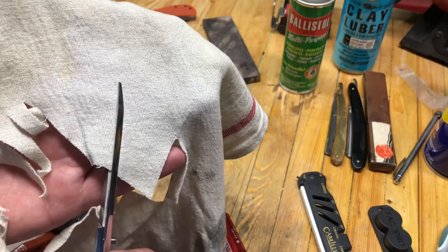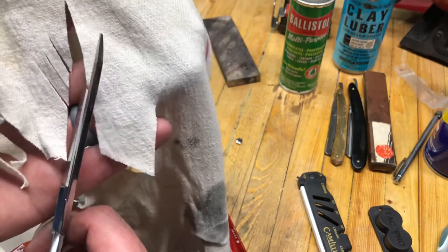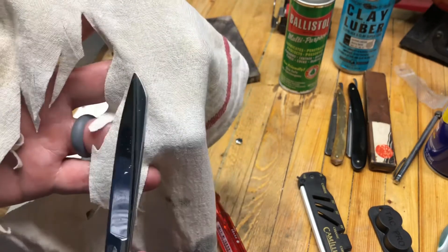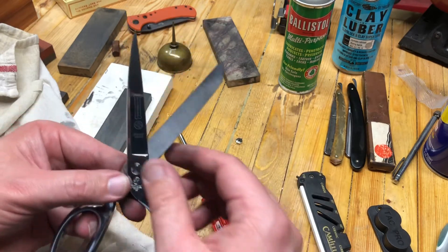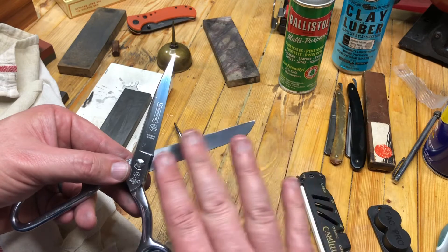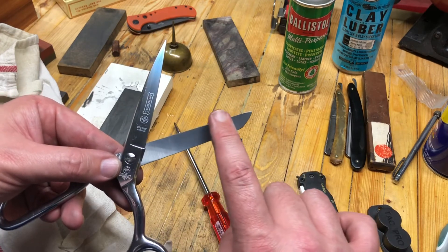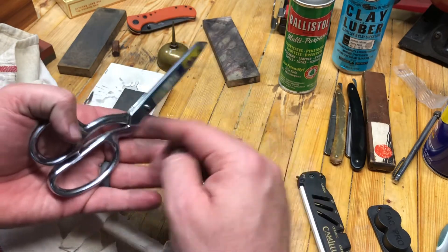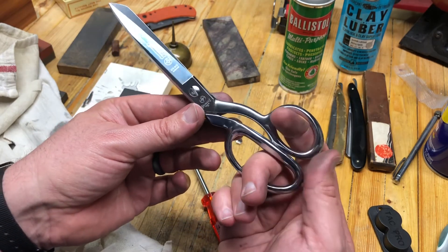I've already tested this — let me show you on camera. Nice, crisp — that spot right in through there that was giving us trouble is not a problem anymore. These are in great shape. Don't be intimidated by scissors, especially if they're a quality pair that comes apart. Just treat it like two blades, run them over the stones, do all the things you would do to a knife or a blade. Just this backside — leave it alone, don't even worry about it; as long as it's nice and flat you'll be fine. Mine was fine. I made sure my bevel was good, and it's sharp enough that I could cut arm hair — shaved sharp. Eagle Run 2-3, thanks for watching.